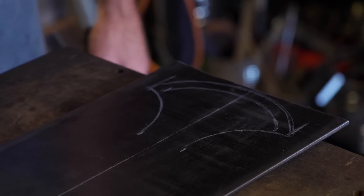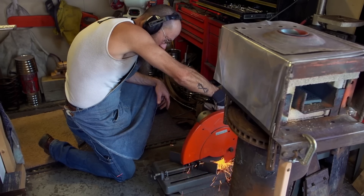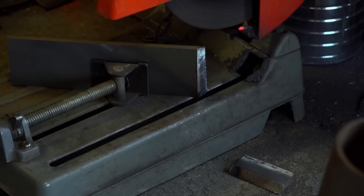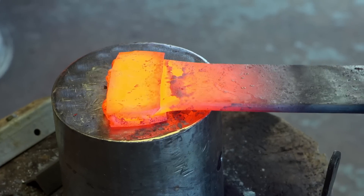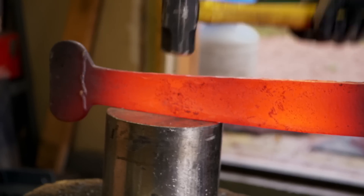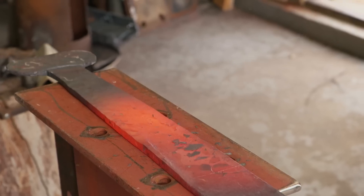My name is Nick Hicks. What I like most about bladesmithing is the artwork behind it — being able to take something most folks would look at as a piece of junk and turn it into something beautiful and usable. I think that is the ultimate artwork. I cut the stock at an angle to establish my scarf weld so that when I stack those billets up together, I'm going to mold those down into the original blade shape. Plan is to move a lot of steel, get this thing shaped, hopefully quenched. It's going to be a big, heavy blade. The weapon was made as a serious chopper — it will be heavy, but when you get it in your hands, it will be a commanding tool.